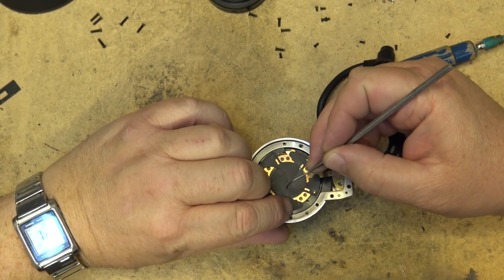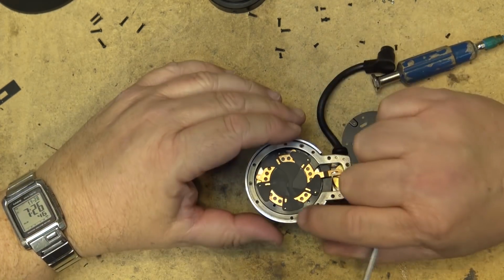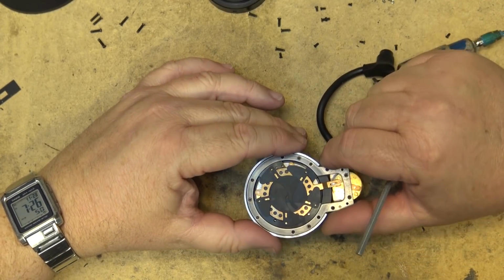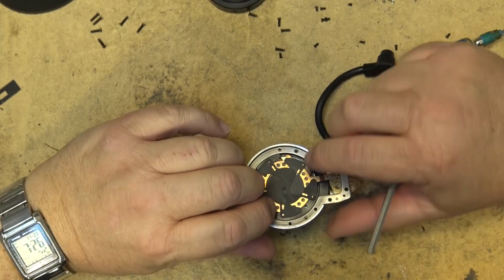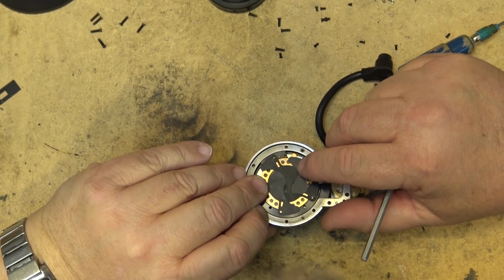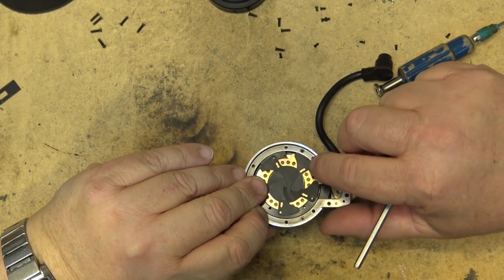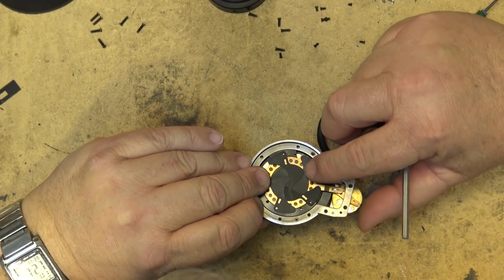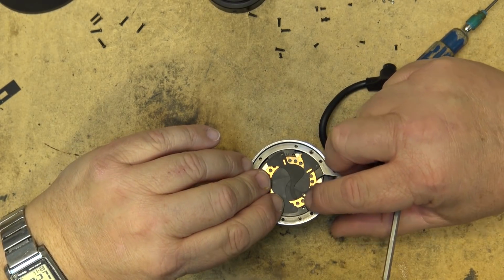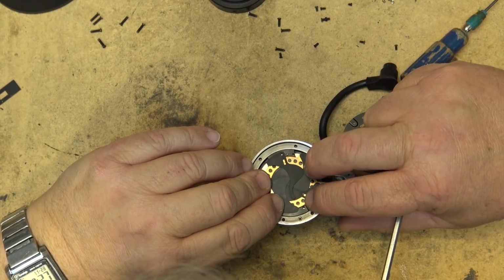Then the manufacturers came out with a lens which the iris and the iris motor was an actual assembly. You just took out two screws and you just slid the iris assembly out. And there was like three screws that held it together, and it's just a two-blade iris, and those ones were a piece of cake. You could fix those ones in like 5 minutes because there was only the two blades. One that slid one way and the other one slid the other way. And those ones are a piece of cake to repair.